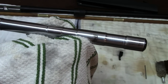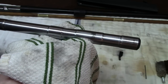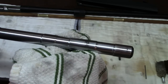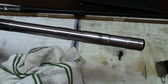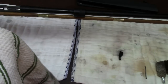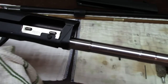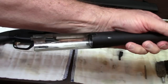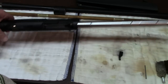There's some permanent staining on the tube from the hundreds of rounds fired. That's just where the stainless steel has become tattooed with a scorch — the same as a stainless steel revolver cylinder face getting that blackening. It's not any harmful issue. You'll find there's not an awful lot of carbon inside the receiver because the barrel extends back through and protects the receiver for about 90% of any issues.